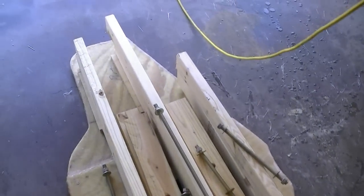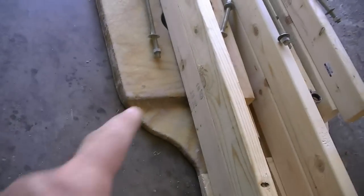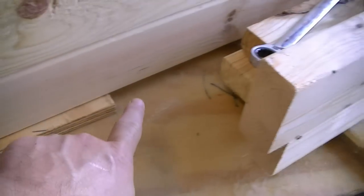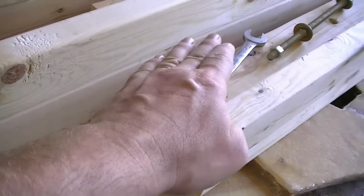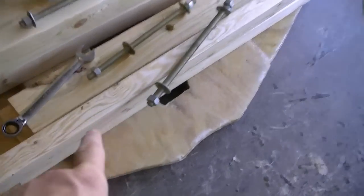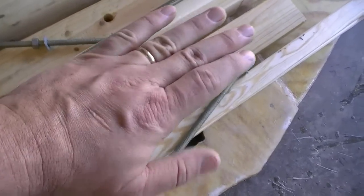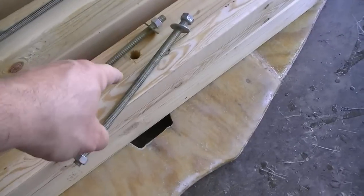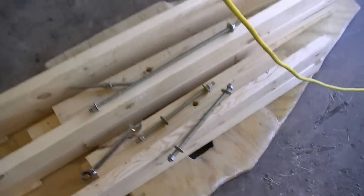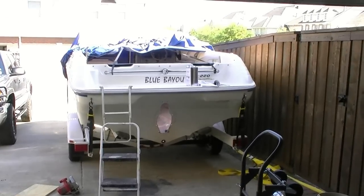You can see I've got all my pieces of wood cut properly and all my all-thread laid out and ready to go. I've got them stacked on top of each other — inside, outside, inside, outside — so I know I've got everything cut. I've got little feet so these are off the transom about an eighth of an inch, and when you tighten it down it will bend down, add pressure here, and grab the clamping there. At the bottom I've got one standing on end and one laying flat. The flat one will give a lot of clamping pressure up here but not so much on the outside, and I've alternated them. All I have to do now is drill through these lengthwise and get them ready, then load everything into the boat.